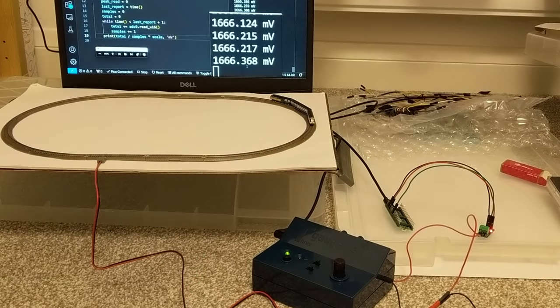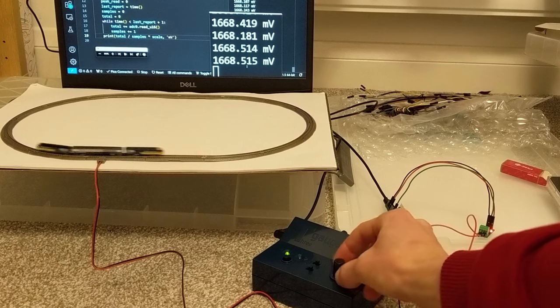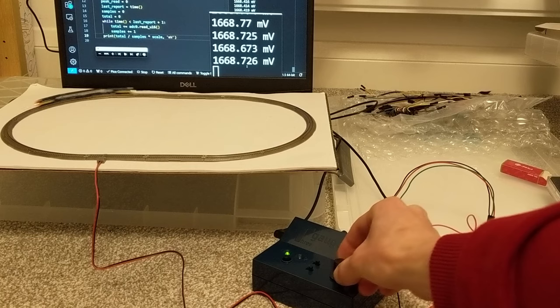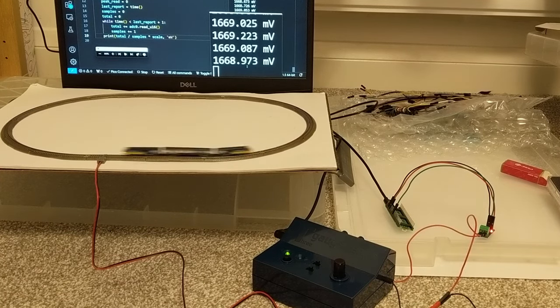I also tried a current detector module, which came in a pack of two current sensors and two voltage sensors for £5.49. It produces analogue output — a voltage which is half its input voltage when no current is detected — but I can't find any information about what it outputs when it detects current. Other similar-looking modules say they output an extra 66 to 175 millivolts per amp detected, depending on the module. The readings from this one fluctuate a bit even when there's no current to detect. My T-Gauge controller controls train speed by varying the duration of pulses of full power, so for any given sampling period there'll be time when there's no current flowing. By taking an average reading over one second the value consistently went up with train speed, so it works, but I think it would take some fine tuning to reliably differentiate between no train present and a train running slowly.